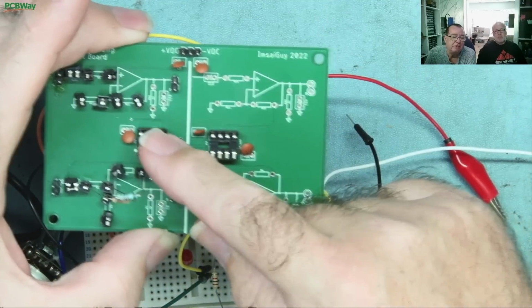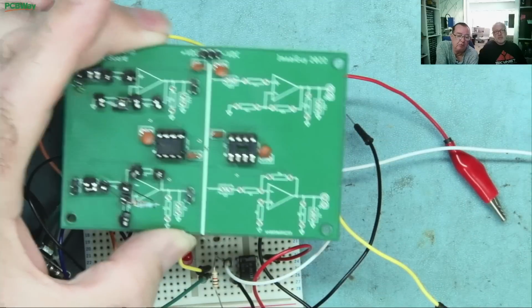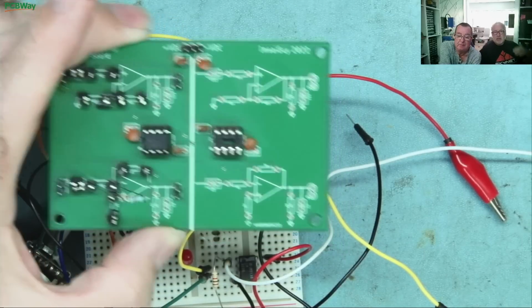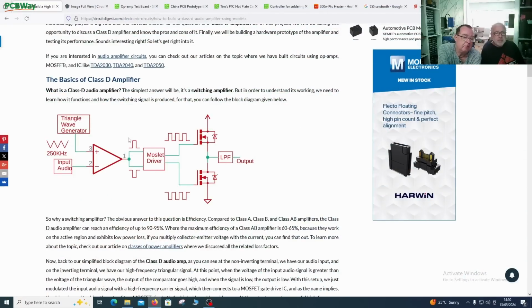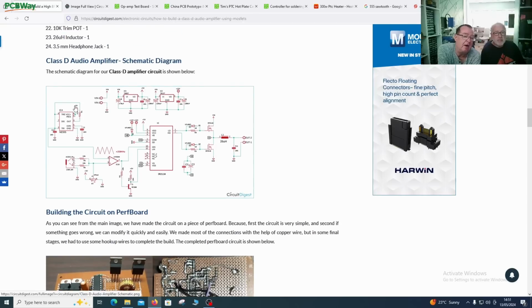So the idea is that the chips can go somewhere else, but the silk screen on the board is going to look something rather like we were just looking at. Let's go there. We have 2 ways of doing this. One is to effectively make the silk screen look like this, with just the various test points on, and we'll put test points on these so you can probe them. Or the other way would be to make it look sort of like the schematic. So effectively all this would be drawn on the board, maybe not the power supply bit, but the other bits, but the components can be mounted elsewhere.